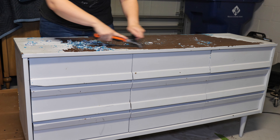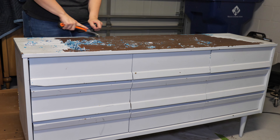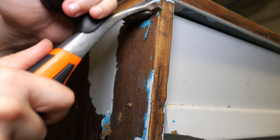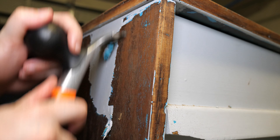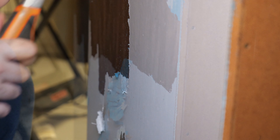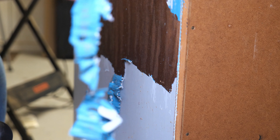If you've never used a paint scraper before, it isn't too difficult to use. The hardest part is getting started, but once you get started on a section, the paint scraper is going to grab onto the next section. You don't want to apply too much pressure — it's more about the angle. You also want to make sure that you're going in the direction of the wood grain. This way, if you scrape the veneer or wood, it's pretty easy to conceal.